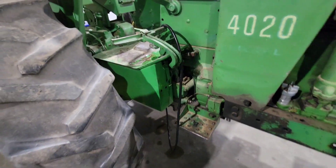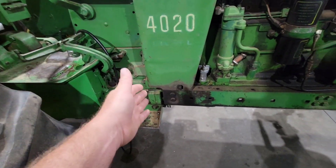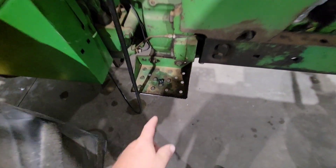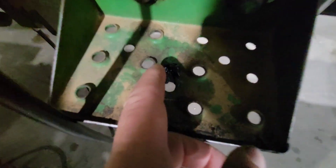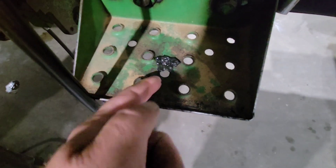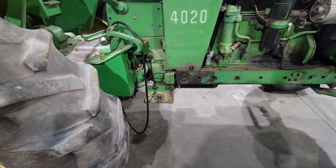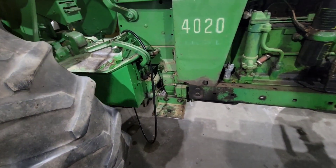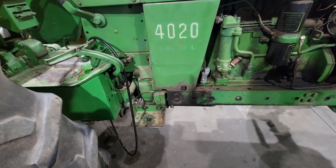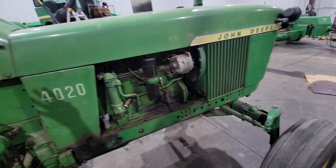What we're going to do today is drop the oil, take that shift valve housing off and see if we can find a broken gasket. We're going to split it at the clutch housing and pull C1 and C2 out. When I pulled the test plug out, this came out of the C1 and C2 port - a plug of metal filings, fines. That's not good.